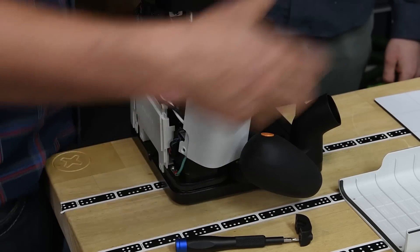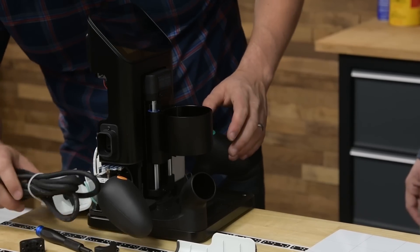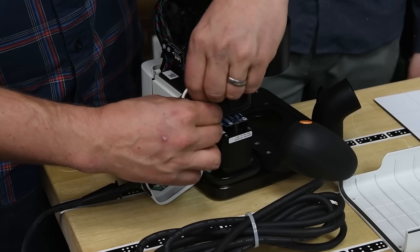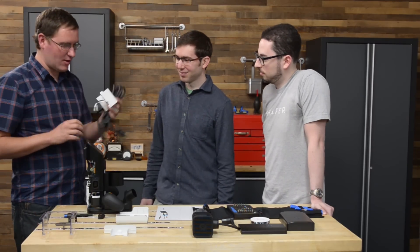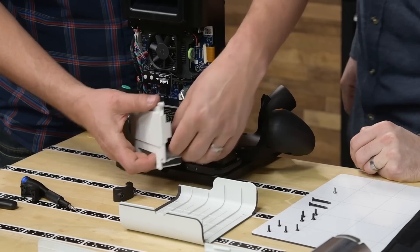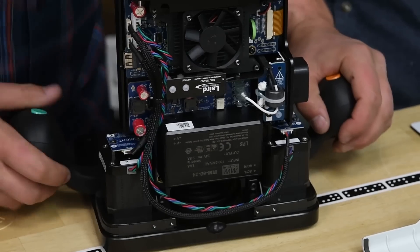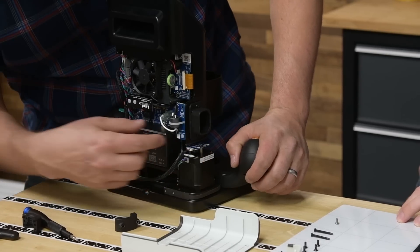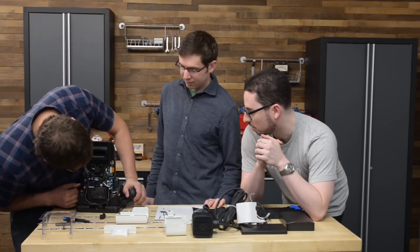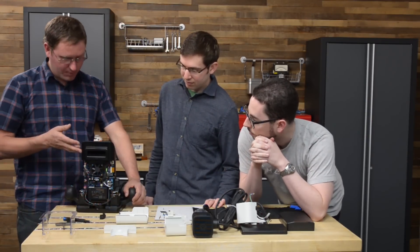There's a hidden snap in there — there are times where you're pulling on something and you'll break the tab off. Be careful because the AC wires go into the power system there. Now we've got two stepper motors here and I see they're labeled R and L — that's right and left. You've got a driver board for each. There are a lot of PCBs in here, which you'll see as you continue taking it apart, because the unique form factor means things need to be in lots of different orientations. It seems like there's more power driver circuitry on the bottom and more processing circuitry as you move up.